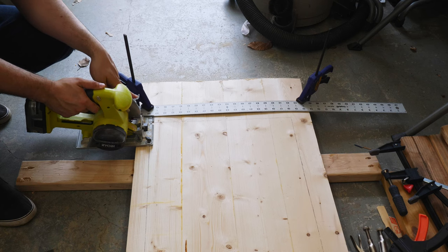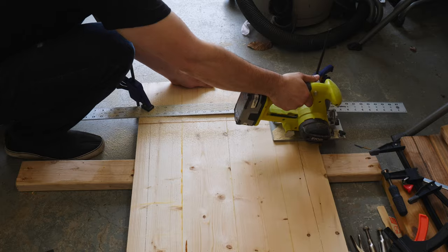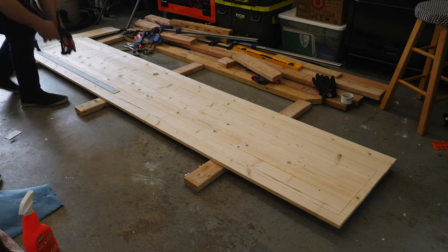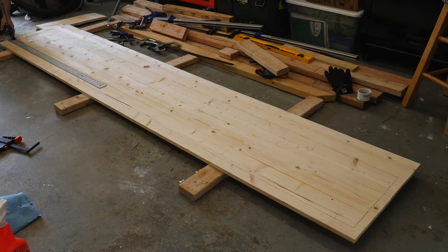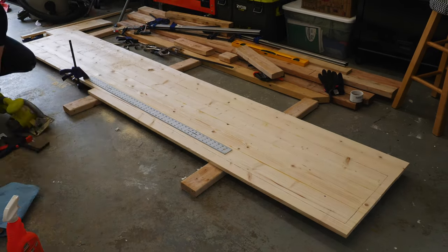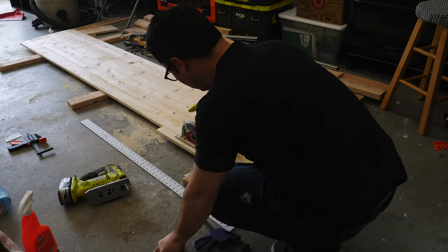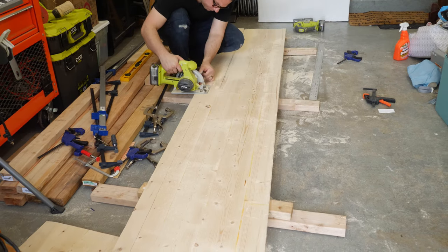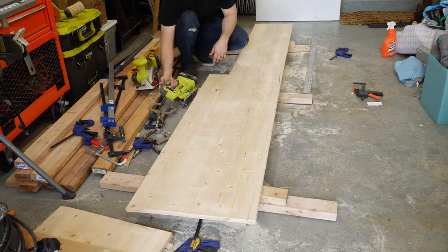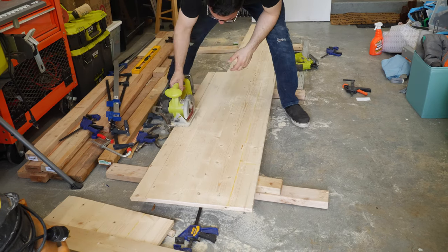As you can see, I'm using a straight edge to run my saw across. I really could only do this on the left and right side because the length of the table uncut was 10 feet, but once I cut it, it came down to about nine and a half feet. I used the straight edge a little bit on the front of the table since it wasn't perfectly straight, then went slightly freehand and brought in the jigsaw to cut some pieces off so I could start fresh. On the backside it was even more complex because I marked against the wall, and the wall is definitely not straight. But at the end it all worked out — I tried to get as close as I could to the lines and then sanded it down from there.